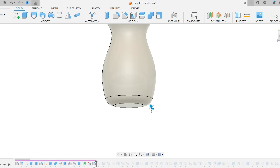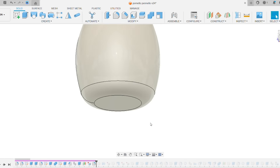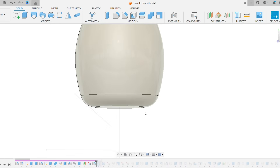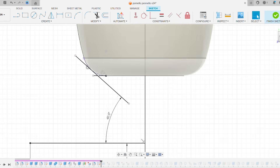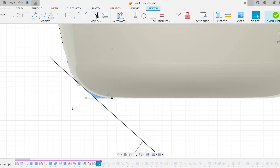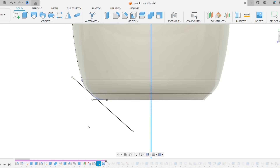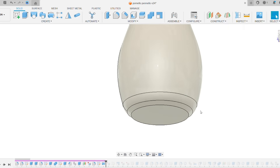On the bottom of the handle you can see how we have a fillet that needs to be printed upside down. As you may know, printing fillets upside down is a no-go, because they cause melting on the first steep layers. We can solve this issue by creating a sketch on the mid-plane, projecting the fillet, and making a 40-degree line tangent to the fillet. This is the critical overhang that would melt. We can avoid that by revolving the area between the line we made and the ground line. The final result is something very similar to a fillet, but printable.